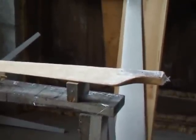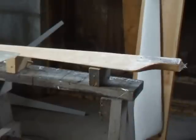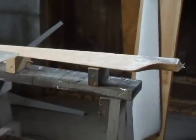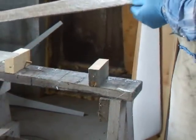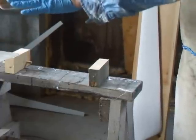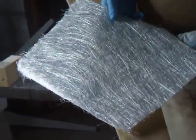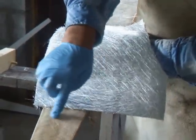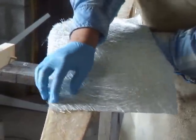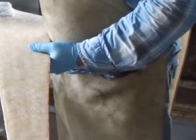There's one of our blades. Now that blade is upside down because I've done one side of the fibreglassing. Before I did any of the fibreglassing with the plain weave fibreglass, I just put a layer of chopped mat — 600 gram chopped mat fibreglass on top. And that's very easy to do. You basically put your resin onto your blade and then just stipple your fibreglass in up to the edge. It's pretty straightforward, the chopped mat stuff.